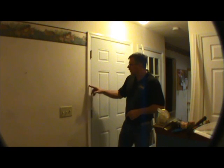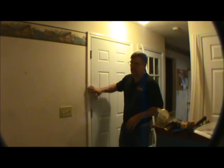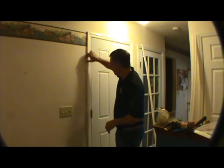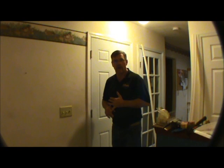As far as nail filler goes, some people use painter's caulk. I kind of like to use a little drywall mud and just do a light sand, because you can build a little bit up on it. You can do a light sand, and once it shrinks, it hides that shrinkage, covers very well on that. And then we'll do some caulking back on our gaps here, which will close everything nice and tight, and also hide up where we'd been, so it's not as obvious, again, if you're not ready to paint the walls right away, which I'm not. So we'll button these things up, and then we'll go back with some of the caulking and then install the hardware.